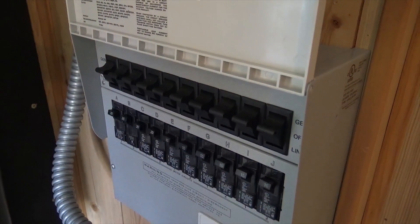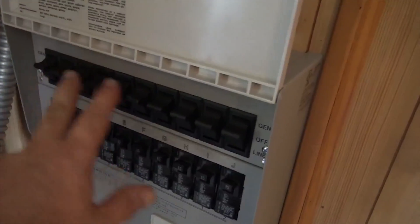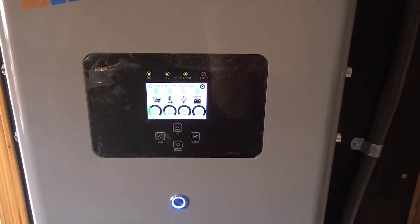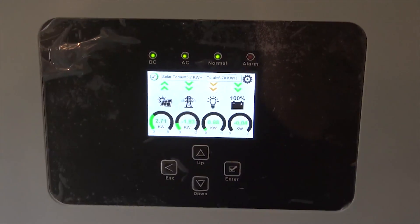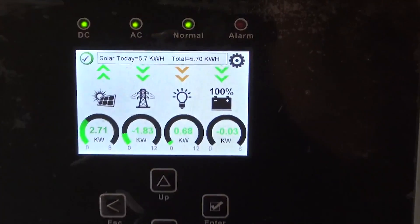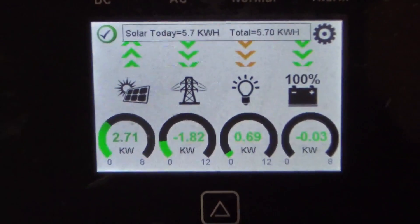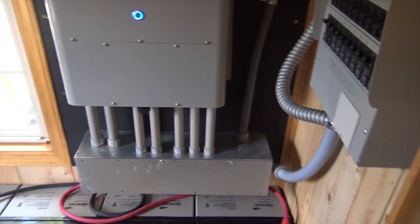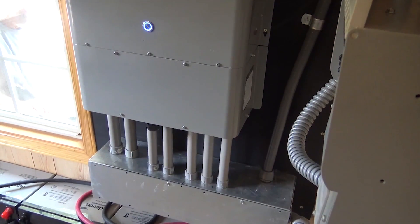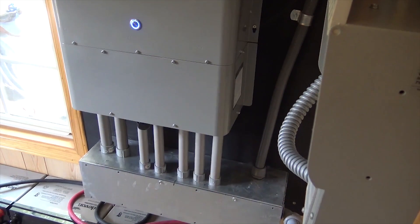She might reach a point where it's a little overloaded and she'll have to manage loads, but she has all the capability to do that. The outbuilding has a separate meter — we were concerned about having two meters, but since the neutrals are combined at the transformer we were fine to send power to both buildings. Once we worked through that technical issue we were clear. The system is quiet and working wonderfully, not throwing out hardly any heat.